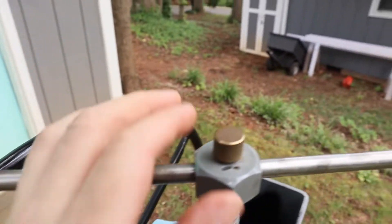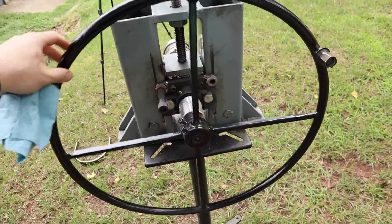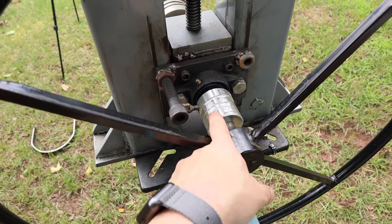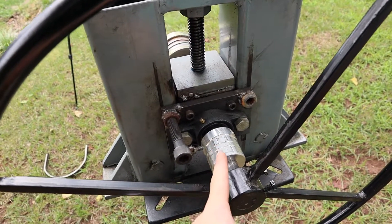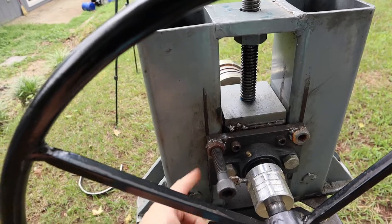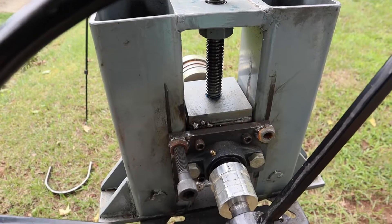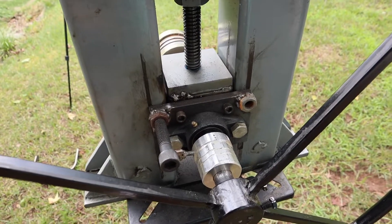This T right here can be loosened for more leverage. Back over here, this is the ring to roll with the hand. This part right here is milled with eight sides — a milled adapter to hook up to the pipe threader. There are little springs that clip in there. This bolt right here can go either here or over here, and that's actually what holds the pipe threader on. That goes through where the trigger guard is. The trigger is zip-tied and I have a foot pedal to operate it.